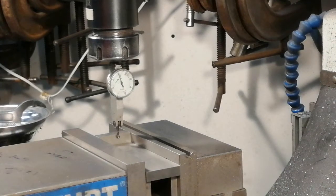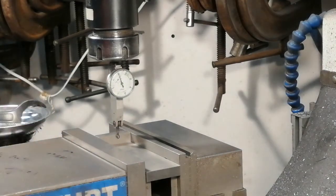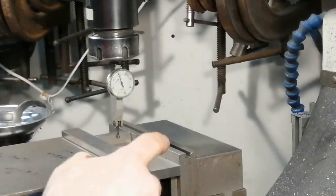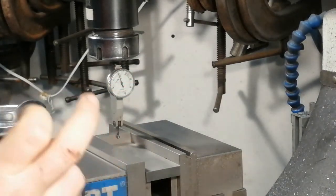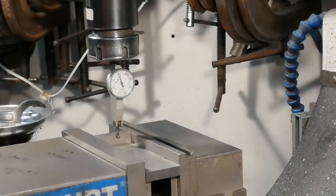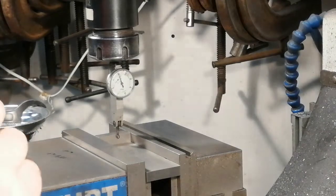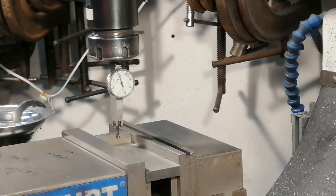Of interest is that the DRO is actually metric and converts to inches, so there are some rounding errors. The gauge blocks here are calibrated for 20 degrees centigrade and are made slightly too small to account for the gauge film — less than a micron. They are manufactured with tolerances mostly on the plus side, so you have to account for all of that, and the fact that the scales should be about 5 microns accurate — at least that's the resolution, and accuracy should be similar.